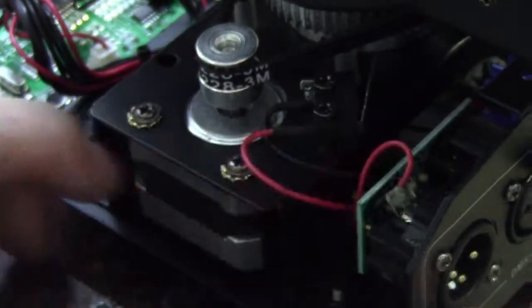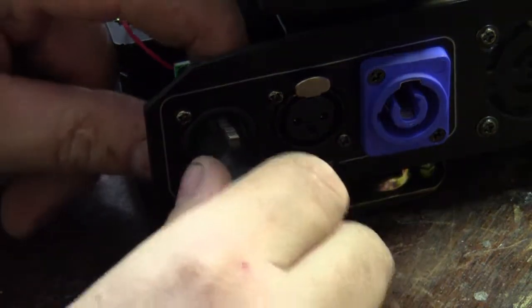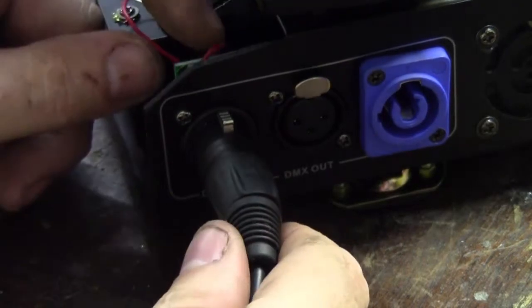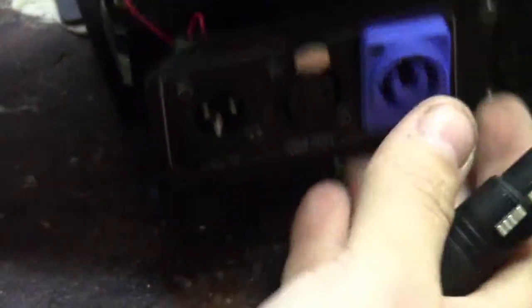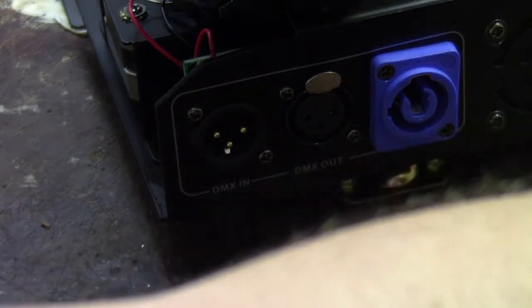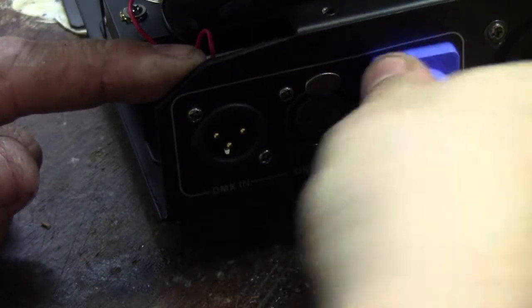This thing should be good to go. I should be able to plug a DMX connector in there. Let me plug this cable in now — it should go in nice and easily. It clips onto that metal plate, so the metal plate also serves to stop the cable from falling out. And if I look there now, that's not causing a problem. It's not bent out or shorting. It still works when I plug in the PowerCon cable. So that looks good.